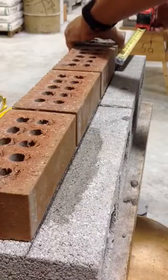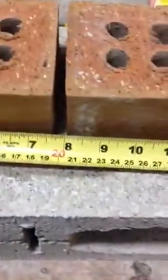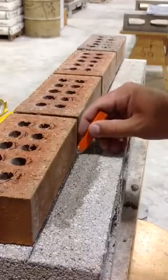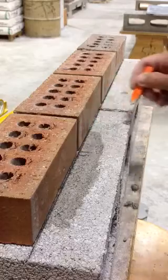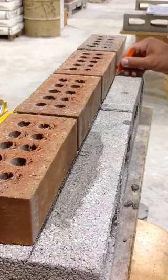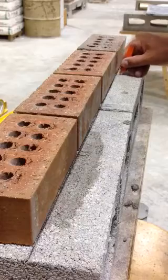I've got to move that a little bit to the right. When you're measuring your 8 inches from the edge, you're looking on the front face, because you can see how some of these bricks are just kind of bowed in the middle. So you've got to make sure that's 3 eighths, that's 3 eighths, and that's below 3 eighths. What you also do — you can trace the brick, or what I like doing is making little lines here to show me where the joints have to be, or where the bricks have to end up. Little dash marks — you have to keep your pencil sharp to help out with this.